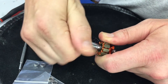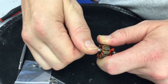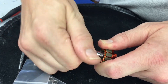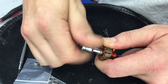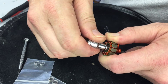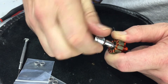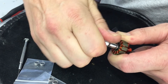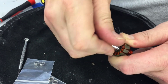Tighten this together, and as we tighten it we're going to use the old bearings on top of the new bearings to slowly push them in. As you can see, I'm getting this done with hand pressure and I'm turning. You'll feel when it stops — the bearings are seated. Take the tool apart.